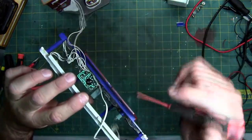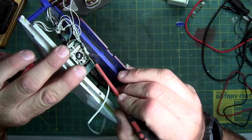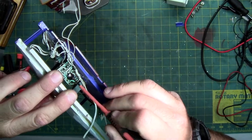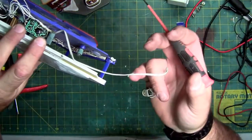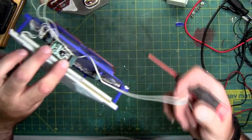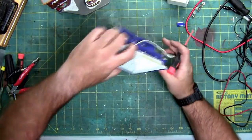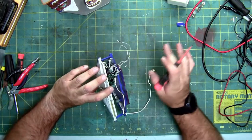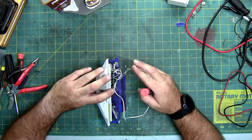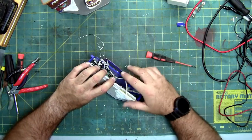These are the two wires for this sign. If you notice right here, there's two bundles that are heat shrunk together. They break off and power the circuit board, and they also go directly to this. These two wires are soldered directly to the incoming power, so it uses the full 3 volts coming in. So there's no resistors, no nothing. It's just direct power right to these wires.